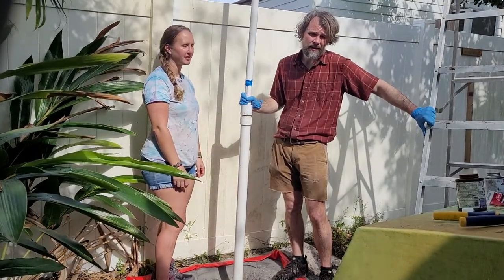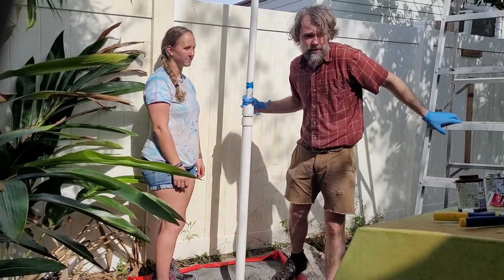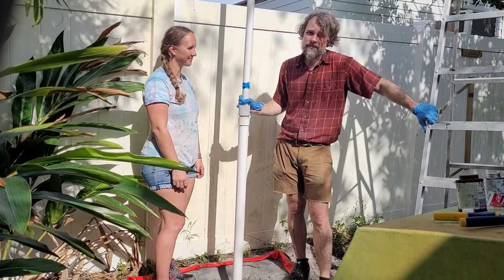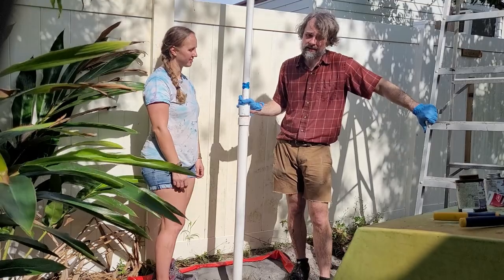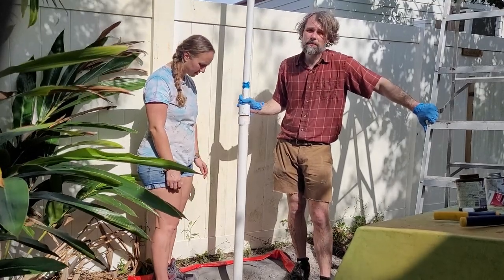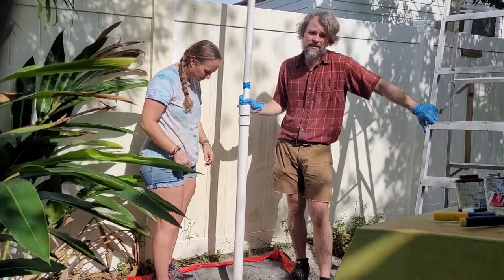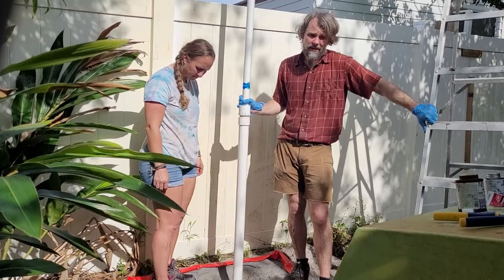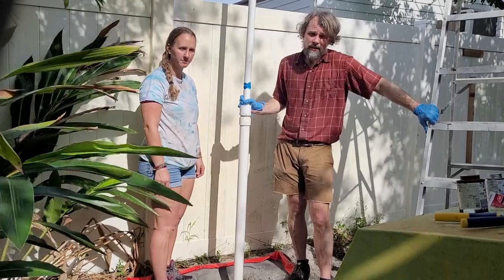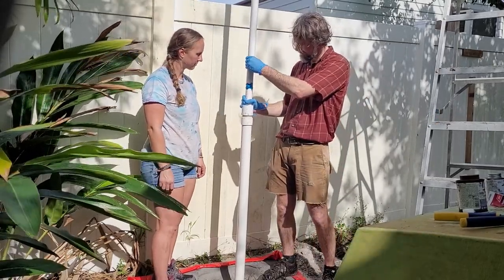And when you're adding sections, we bought plumber's grease to put on the threads. Use a lot of it. It makes getting the pipe sections off a lot easier. Otherwise, you're struggling. And when you're torquing on the pipes, when you've got 20 foot underground and a seam already down there, it could get leaks. So I think we went through just about a tube per well. So well worth the dollar or two.